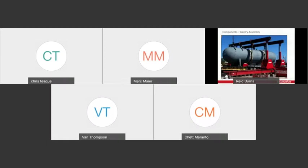And next we've got the gantry track. Your gantry track is typically 3 feet center to center of the members. Some are narrower at 2 feet, others a little wider depending on the capacity and the make and model. Some units have got spanning capabilities, others don't. Again, one of the beauties of a gantry arrangement, it's a very modular system. And so there's lots of different parts and pieces that you can use to fit the needs that you see most often.